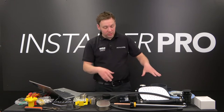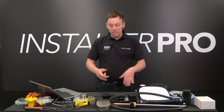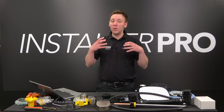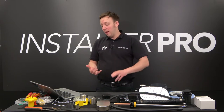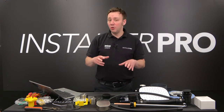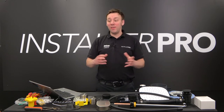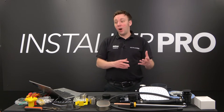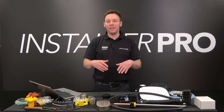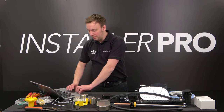Another question with regards to system suitability as well. So can it be pumped? Yeah, absolutely, Graham. These can be fitted onto any kind of conventional shower pump that you require. The only thing that we do stipulate, either when pumping it or when it comes to potentially mixed pressures, is just ensuring that the pressures across the hot and the cold are nominally equal. We don't normally advocate with any of our mixing valves that the hot, for instance, be pumped and the cold on a mains. Any thermostatic mixer to work best and to maintain a nice stable temperature, you want nominally equal pressures across both supplies.